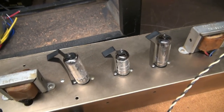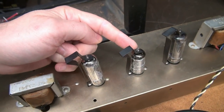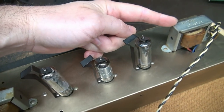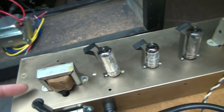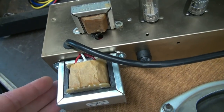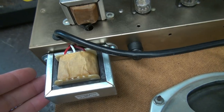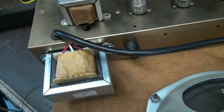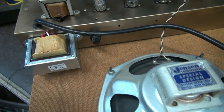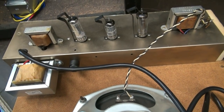There's a little paper identifying the Harmony amp, and here is the chassis that's already been removed. The tube lineup: you got a 35W4, 12AU6, and a 50C5 — this is your output tube — and there is the output transformer. This other transformer I really don't know what it does; it's not connected. And there is an isolation transformer that somebody installed hoping to eliminate the ground issue, but in this case it just produces a lot of buzz, distortion, and yes, a little bit of smoke. So I'm going to remove that, strip it down, and do something D-Lab's way.